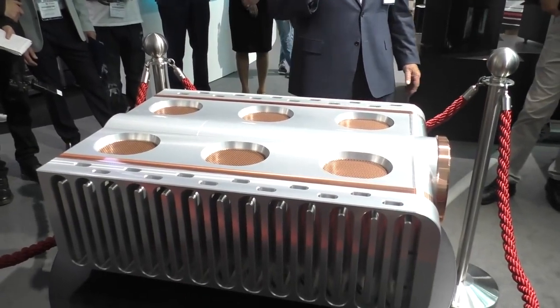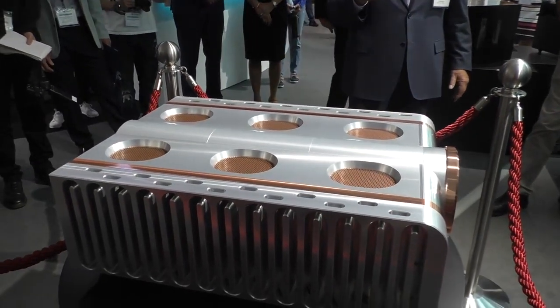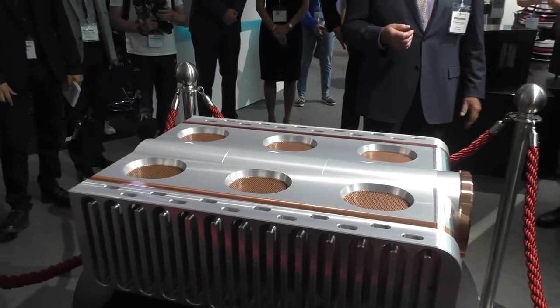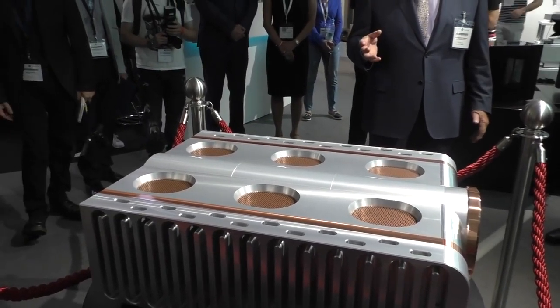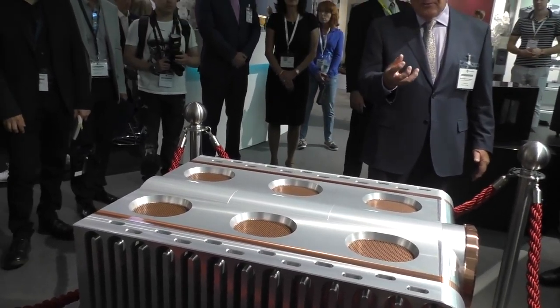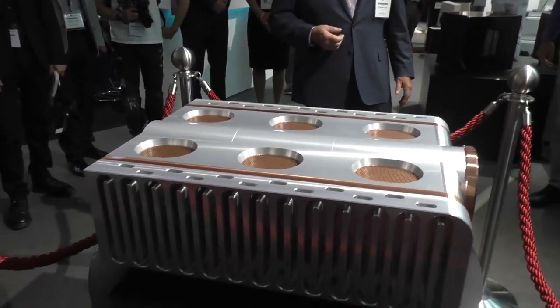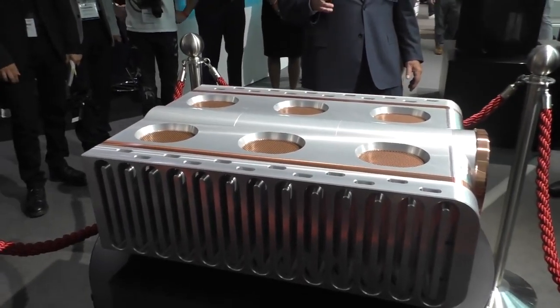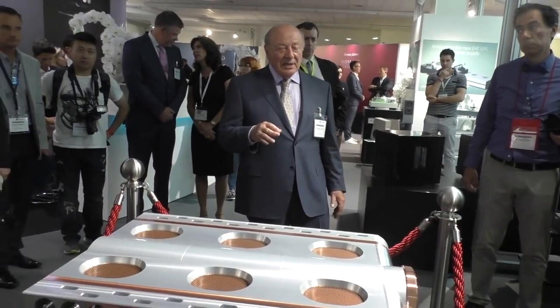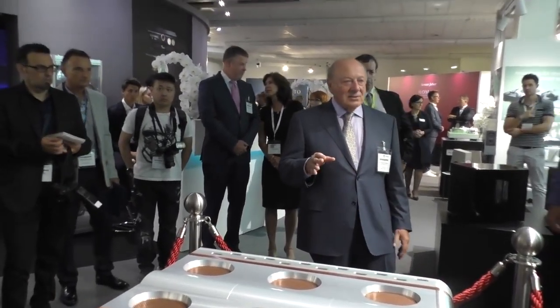It's got 307 hardened stainless steel feet on it that are rounded instead of pointed. Because I figure no matter what kind of floor you put it on, it's going to break it if you have a point on it. So I made a rounded foot that it sits on. So that's, yes, is it biased Class A? It is not Class A. It's Class AB, but a little over 100 watts is Class A.